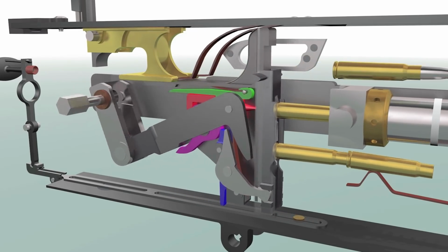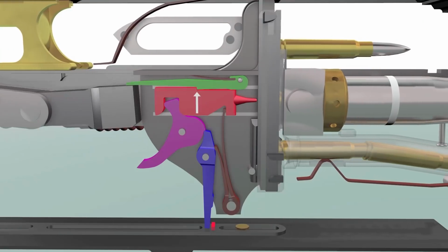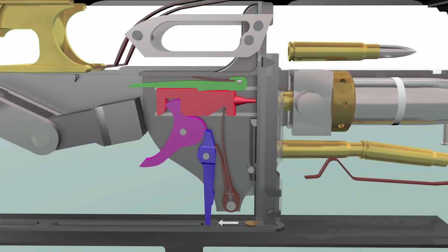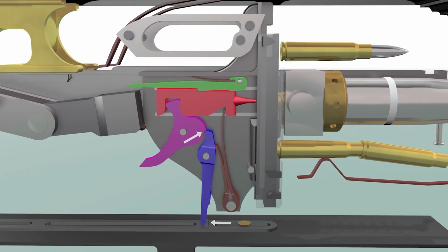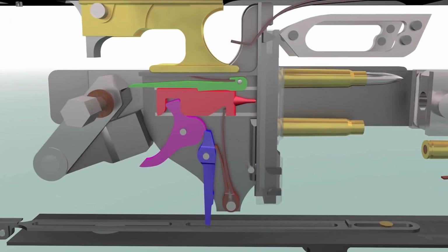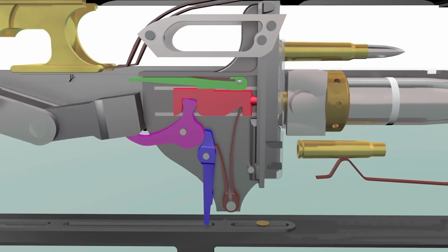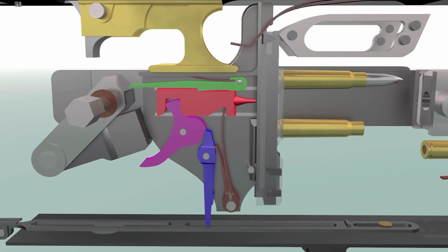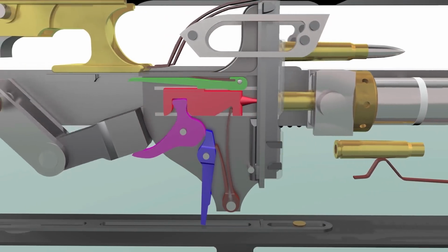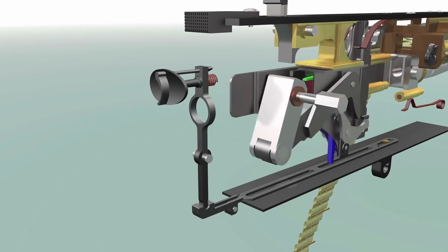All right, now let's look inside that mysterious lock. Along the base of the receiver in gray is the transfer bar from the trigger. When depressed, it pulls back on the blue sear, which releases that little pink part there. Essentially, it's a rotating cocking piece, releasing the striker forward, and being cocked at the rear by the shank at the rear of the lock when it turns downward, almost like a thumb pressing down a hammer. The green bit is a safety, preventing out-of-battery fire until that joint comes all the way back up and puts everything into lock. And really, that's the whole of the action.